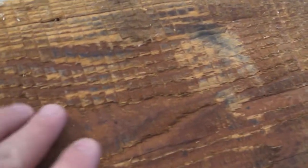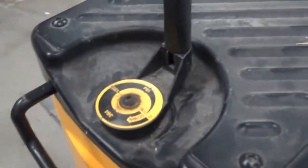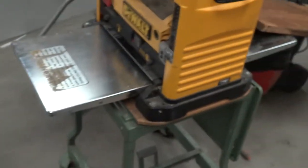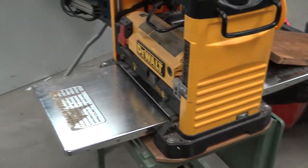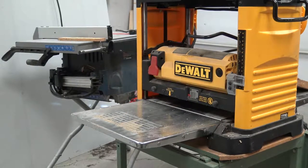This is the first pass — hardly did anything. Mostly got right up here, these lighter bits, just barely nicked those. I'll take a little bit at a time since this is pretty much just as wide as the whole planer. I'm going to do a quarter turn, which is like a 64th of an inch — or maybe even an eighth turn if it's really having a hard time. What would that even be, a 128th of an inch each time?